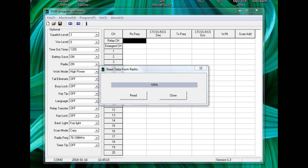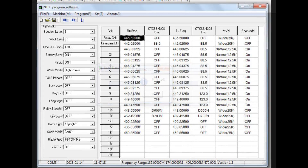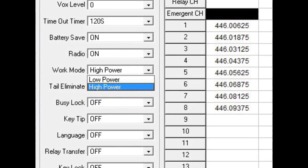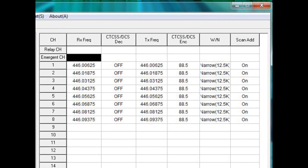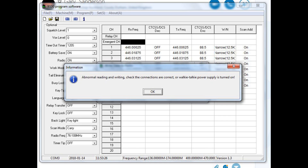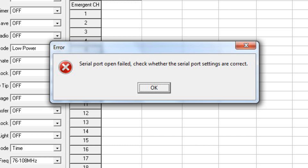So I restarted the 9100 software and this time I was pleased and relieved that the software did in fact talk to the radio. I was able to drag across all the frequencies that were pre-programmed on the T1. I was interested to see the power output since I was only getting about just over half a mile. There are two settings - it just says high and low - and my radio was already preset by Gary to high. The 9100 software is pretty intuitive and easy to use. All you need to do is go online, find the eight PMR frequencies, and copy and paste them into the channels you wish to use. I did have one little issue getting the software to program back to the radio, but that was me being a bit stupid - the software remembers which COM port you used, and I had plugged it into a different port on the laptop. Once I used the same port for the whole operation it went quite smoothly.